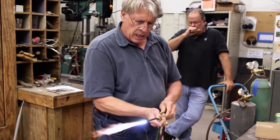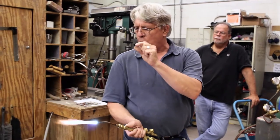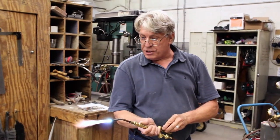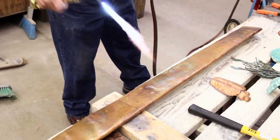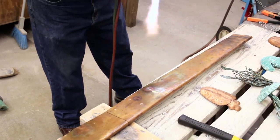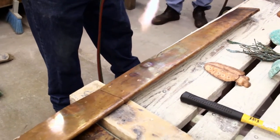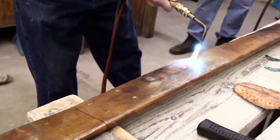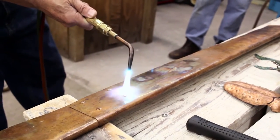Add the oxygen, and instead of that hot white-blue flame you want for welding, you want a reduction flame that has a little more settling in it. You can see when you touch the metal and pull it away you're going to get different colorations — they're very subtle. I'm going to turn it down a little bit; it doesn't need to scream like that. Mostly purples and golds come out.